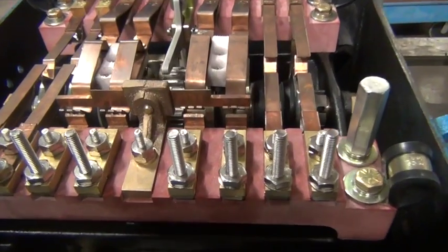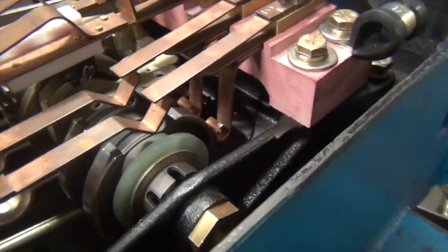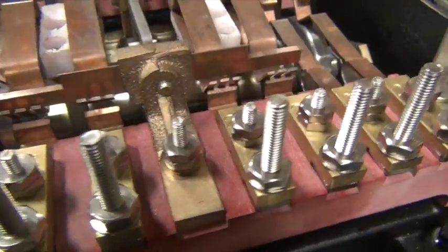If these conditions have not been met, then it will be necessary to lift the controller out, rotate the gear on the controller one tooth, and then reinstall it and re-verify it.